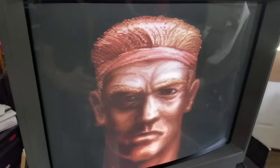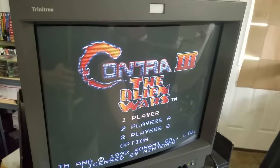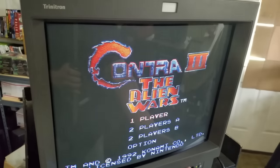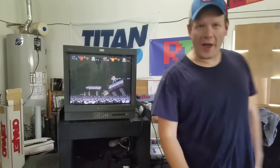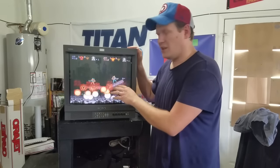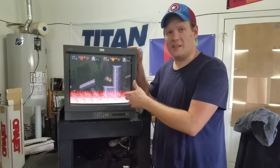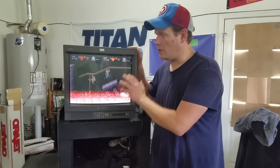Let's take a look — see the contrast. We can take the contrast down a little, and same thing with the brightness. Let's take another little tour around it — a very beautiful monitor. RGB Sony. I hope today was helpful. You can maybe see some scan lines on there. This is a very sharp, clear, clean, and crisp picture. 600 TV lines is a very good sweet spot for RGB and 240p signals, and even 480i will look really good on this monitor.